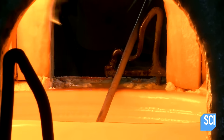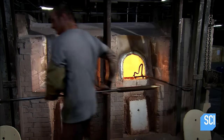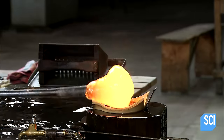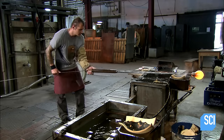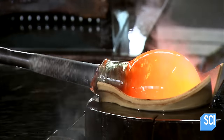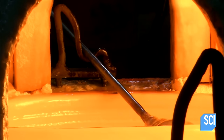A furnace melts silica sand and other natural materials into glass. The starter begins by inserting the end of a blowpipe into the furnace. He takes a small amount of colorless molten glass out of the furnace and rotates it in a wooden mold lined with heavy paper to soften the surface. Then he inserts a metal needle through the blowpipe to create a pathway for air, before returning to the furnace for more molten glass. The artisans make multiple trips to the furnace, shaping the molten glass in stages so it's easier to handle.